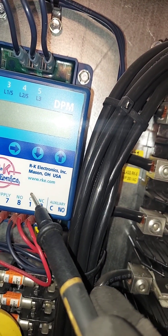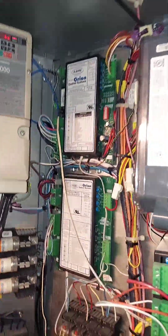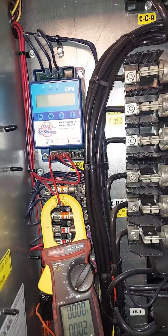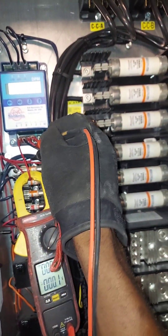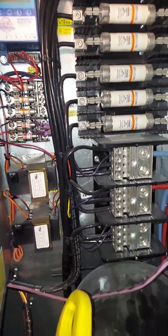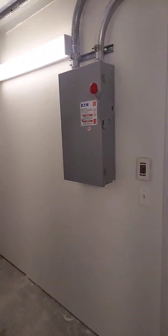When this phase monitor is active, it closes this contact — these two red wires get shunted, common and normally open close, completing the circuit so the drive can run. There are other things in series with this drive too. I tried to check potential across the contacts, but that's a futile attempt because the low voltage transformer — which is right here — may also be impacted by the missing phase. So there's no point in checking that.